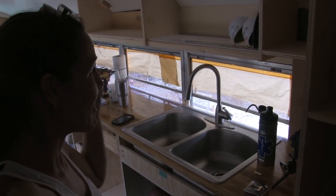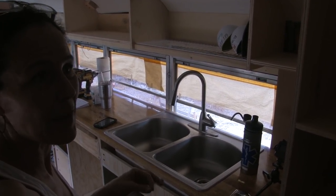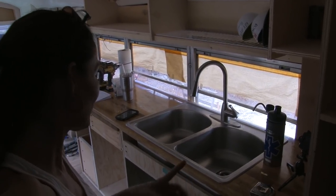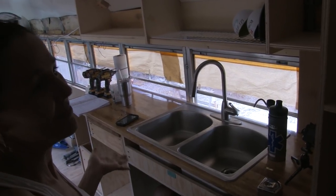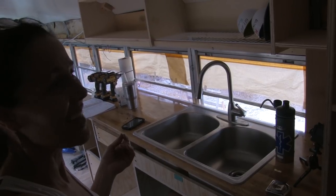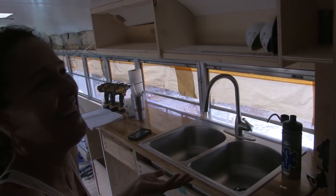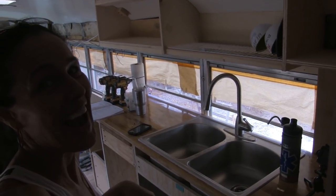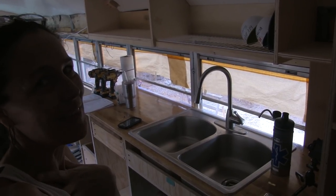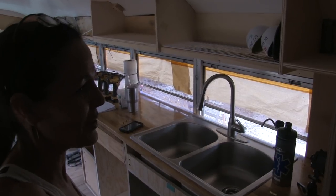Essentially, right now it's a 4-stage water filtration system, and we're taking out one of the stages, which is the reverse osmosis stage. It still does a massive amount of filtering. It just doesn't do things like kill giardia, which, if you're getting giardia in your tap water, you need to move. We're going to be filling with municipal water, so I don't think we really need the reverse osmosis step, and it won't be wasting water once we take that out.